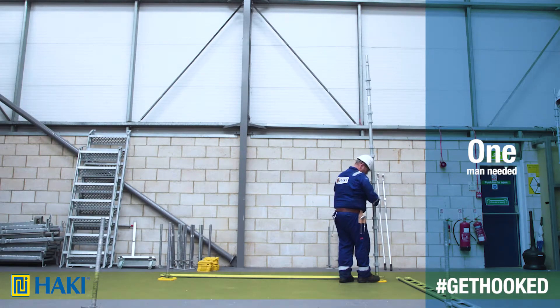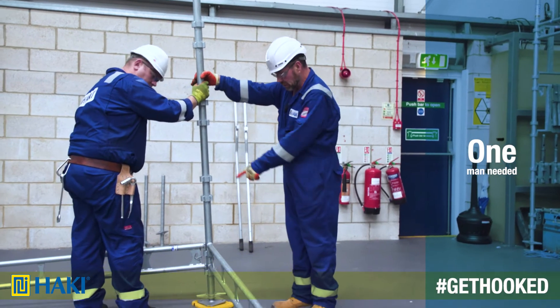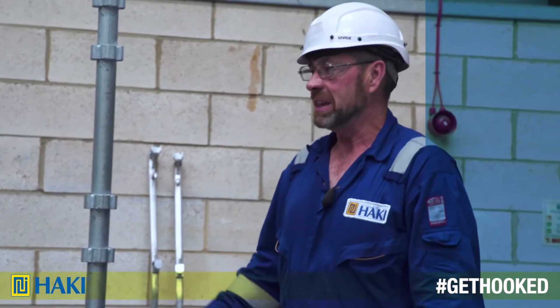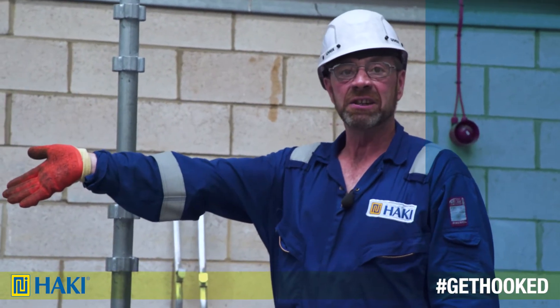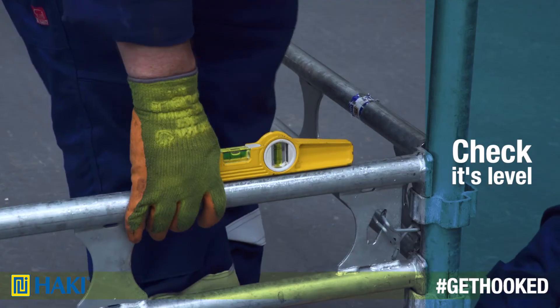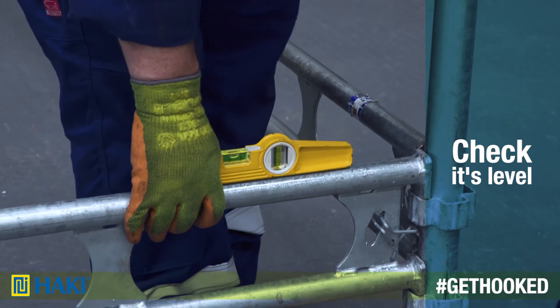As you can see, one man has been able to put the standard up and two ledgers in and left that perfectly safe — it can't fall over — which enables him to determine where the next standard is going so he puts it in the right position. Once we've connected all the base together we'll now level this, and that is the only time that you need to use a spirit level.